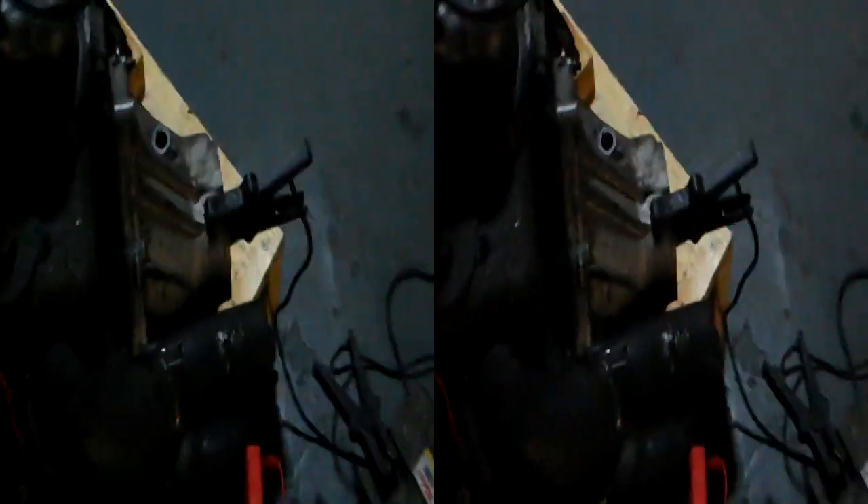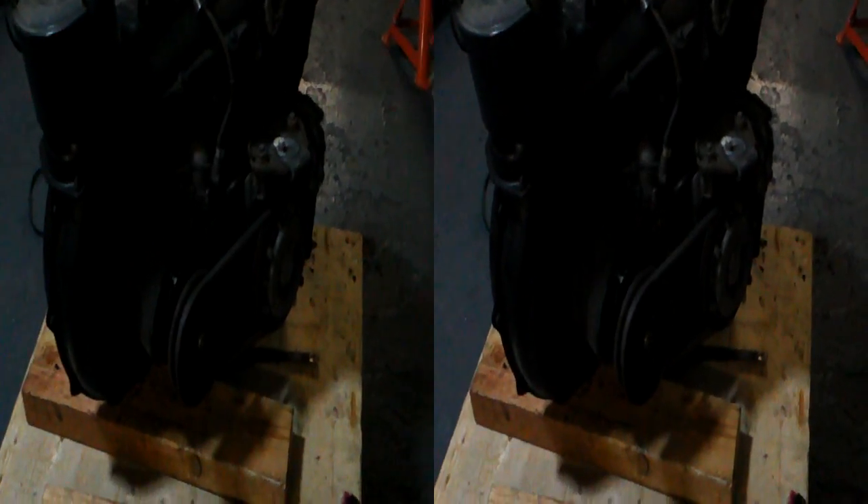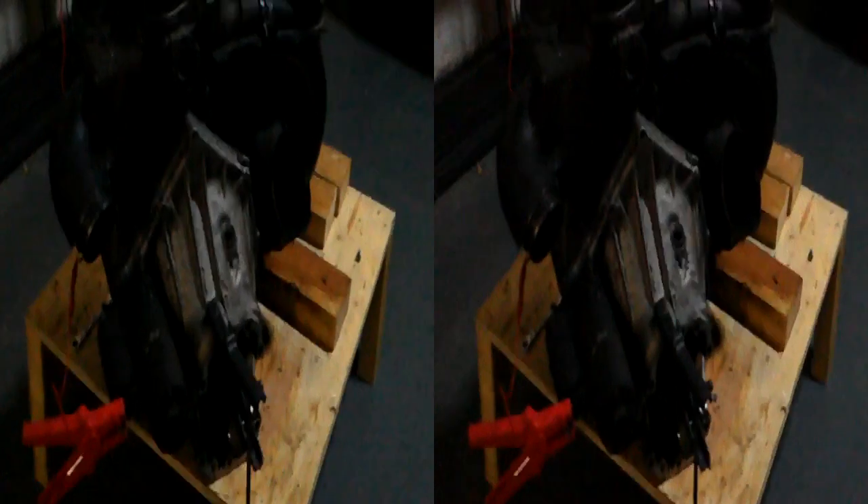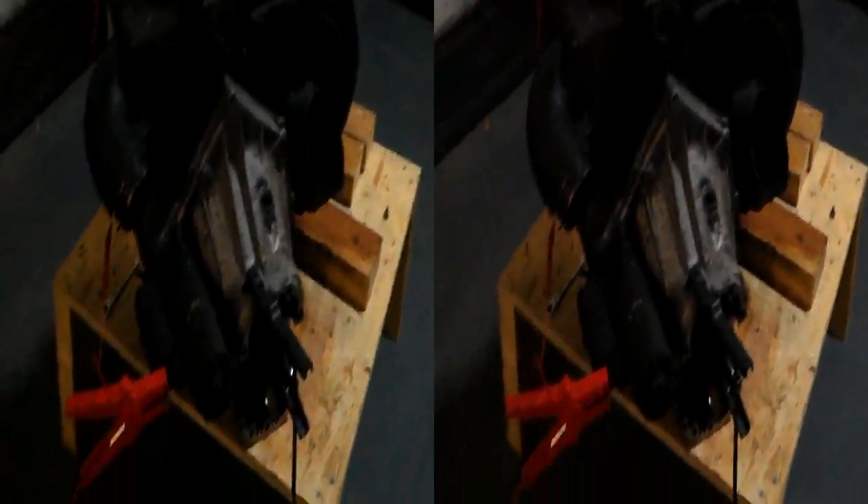This is the engine that's going to power the generator — a Fiat 126 650cc engine. On the left-hand side there's a cowling to feed it with air, and there's a generator, or rather an alternator, which I'll probably remove because it won't be needed. I've put the gearbox bell housing back in place — without any gearbox — so I can attach a starter motor.